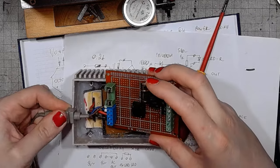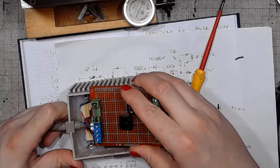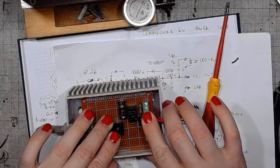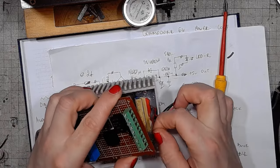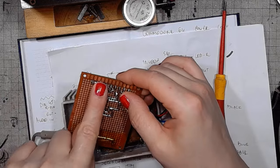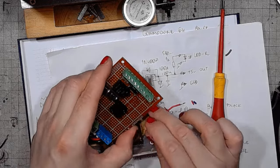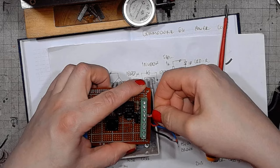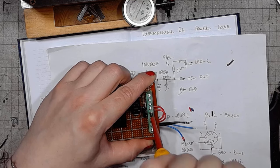And that would be the primary side. And let's try the secondary. Here I've got the 9-volt AC on those four terminals, and that would go to the black winding. And the next two screw terminals would go to the other 9-volt AC that powers the power supply.